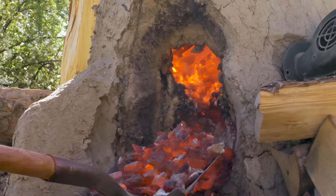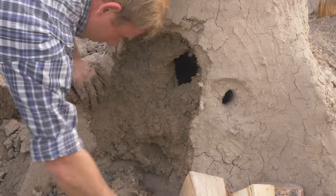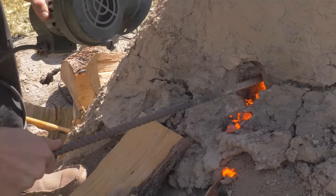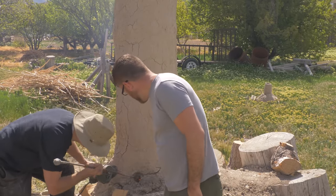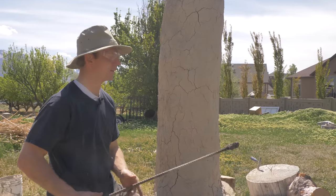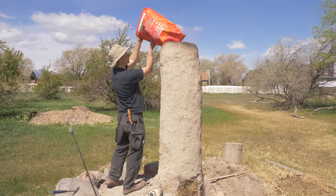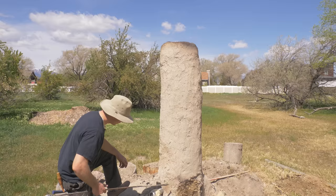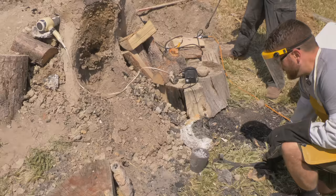What's visible seems like just slag — dirt turning glassy. With a failure on the first attempt, we repaired the structure and strategized for a better solution. This is slag from the end of my rebar that collected every time I stabbed through the air inlets to keep them open. The biggest issue yesterday was that the walls of the furnace were melting before the iron did — which seems backwards. So this time the strategy change is giving it longer in the furnace by filling it up more with charcoal, so the metal sits on a bed of charcoal for a long time to heat up. And we're being much more zealous about keeping those air inlets open. If we're going to have a shot to pour iron out of this, it's going to be now. Let's do this.